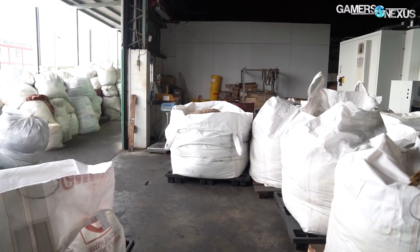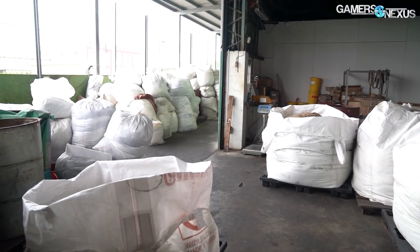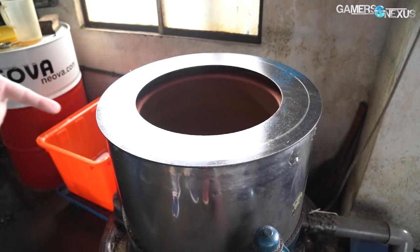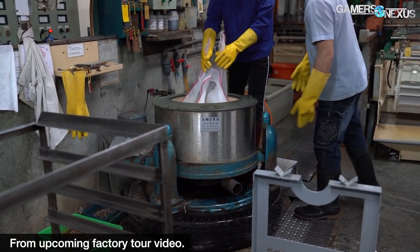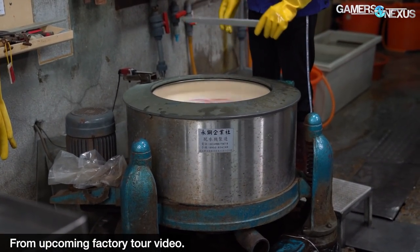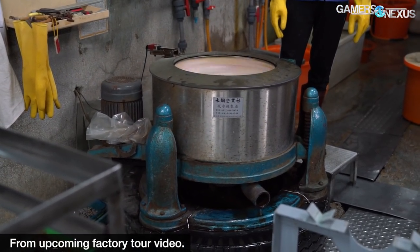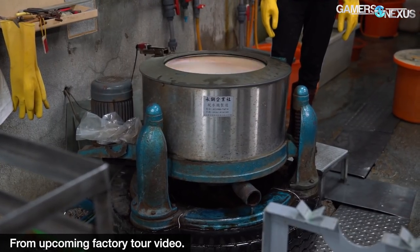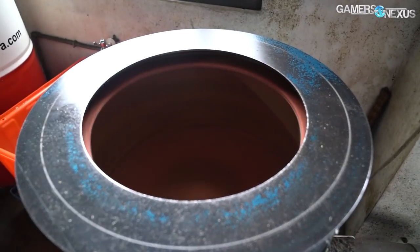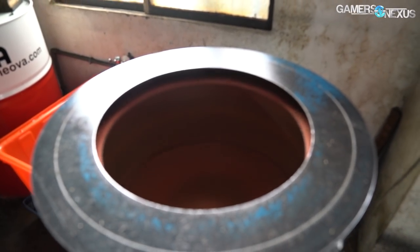All of the copper and aluminum scraps from the fittings are dumped by the machine into a large bin and later bagged. Bits Power takes the bag full of copper shavings and places it in a whirling dryer that rests atop a massive truck tire. Although it looks homemade, this is actually a pretty standard machine used for drying small parts in manufacturing — the tire makes for a great natural shock absorber that copes well with the high speed of the dryer. The metal supplier has a synergistic relationship with Bits Power, wherein Bits Power can return the excess material as recyclables to the supplier in exchange for a rebate on its next order.